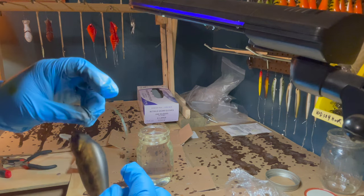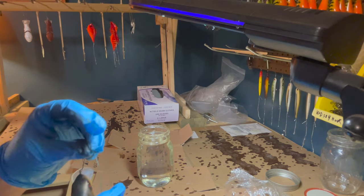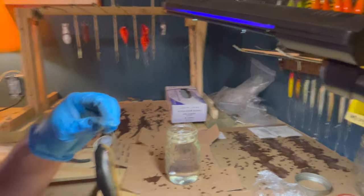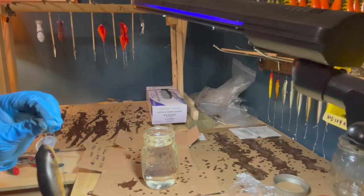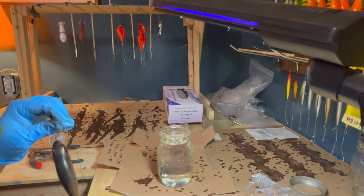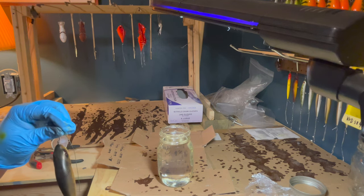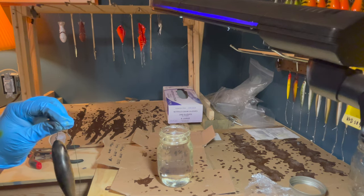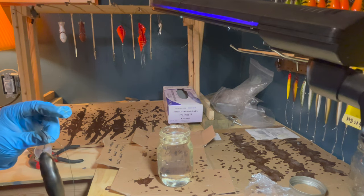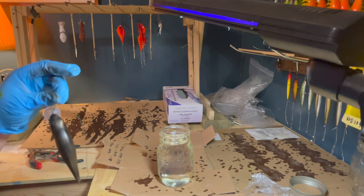All right, everyone. So, we're going to give this a try. If anyone wonders why my voice is so muffled, whenever you're dealing with KBS, you need to make sure you're wearing a respirator like this. Stuff is really nasty. When you get the KBS, you get a whole MSDS, material safety data sheet, of all the hazards that are involved with it. So it's not something to be trifled with. Definitely recommend making sure you have the appropriate gear when you're working with KBS. Otherwise, if you don't want to deal with this, use a DevCon 30-minute epoxy, and it's nearly as good.